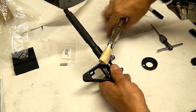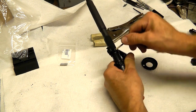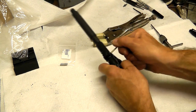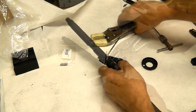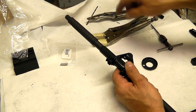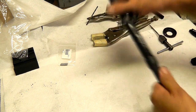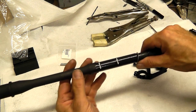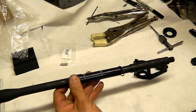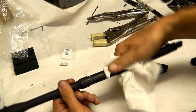Let's take it apart right now and we'll see what we've got. This drill bit shank is really in there nice and snug, which is a good thing. Alright, that's a number 30 drill bit shank I shoved in that hole, and we drilled it with a number 30 drill bit. You see how our front sight lock pins pass through the barrel.